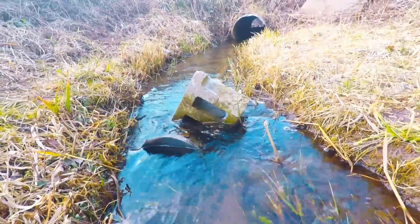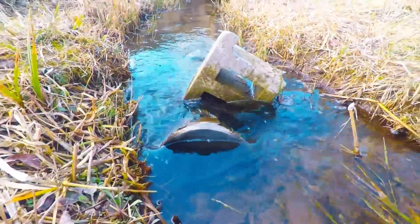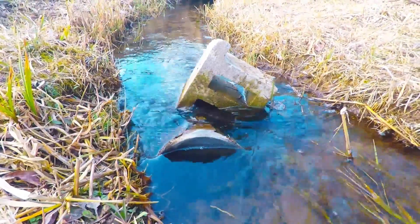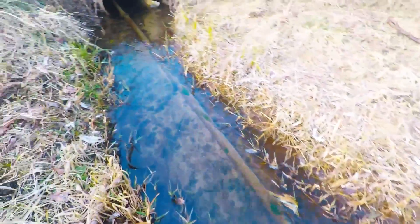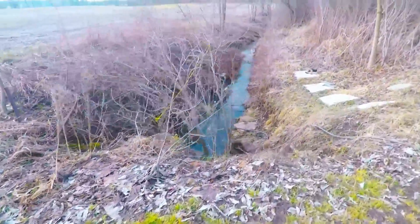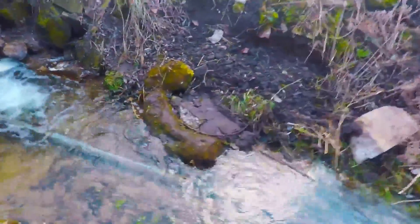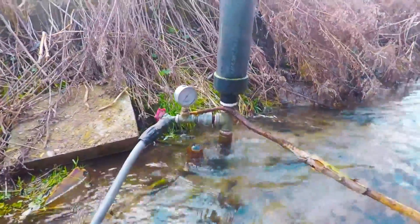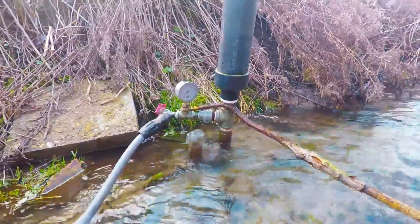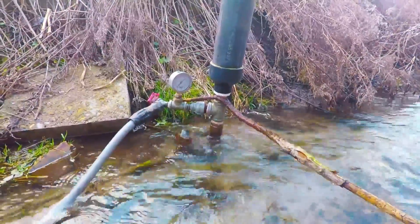There's a slight dam with different levels of weirs in it so that different types of water level out. Fully screened stainless steel and aluminum mesh stainless steel cone. Two inch pipe all the way through the culvert, then it goes two inch on the 45s. It's got a one inch reducer around at the valve, which is underwater. Then it goes to a one inch ram. A one inch ram will build up a lot higher pressure than two inch — this is the original one I built. Maximum was like five PSI, but this is actually building up to 60 with the valve closed. The other one, like I said, five.